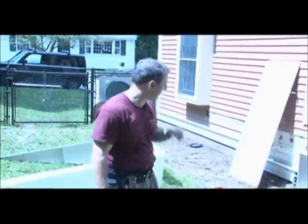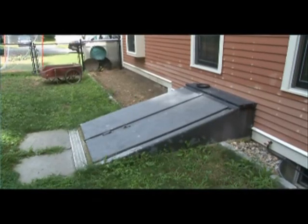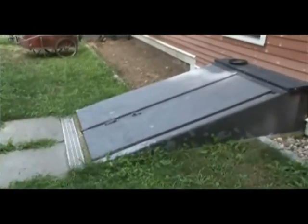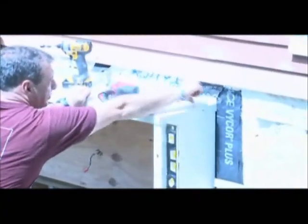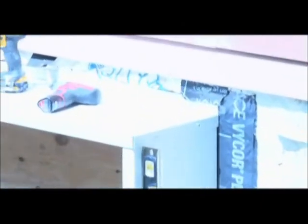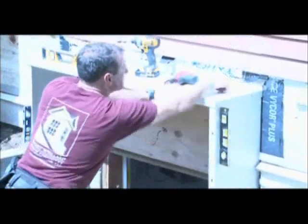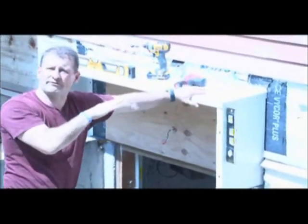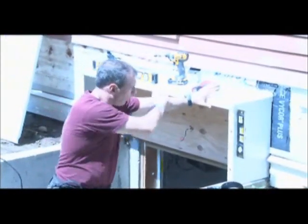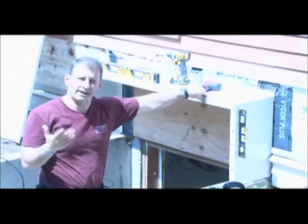Let's talk about what I've started already. We had to remove the old door, and in order to do that, we also had to remove some of the siding, because there's a flange on the top piece that the siding actually covers. Not only should you cover it with siding, but we're going to cover it with a rubber membrane made by Vicor — it's going to cover this joint here under the flashing so that any splashing water will not find its way into the basement entryway. Once this bulkhead is reinstalled, we can tie in the siding and trim again — that's the easy part.